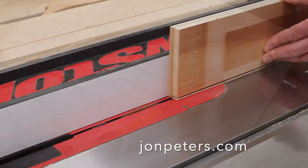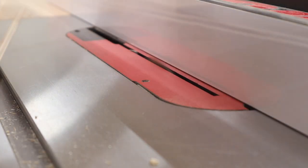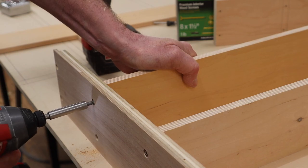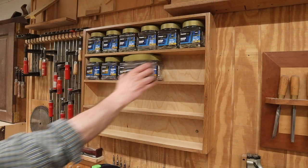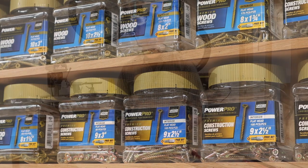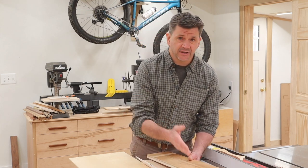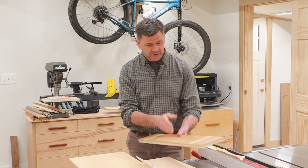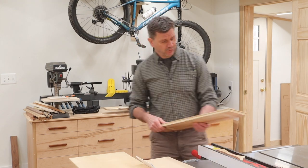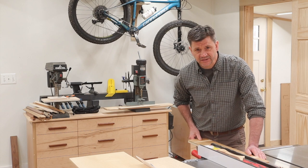Today I'm going to build an organization cabinet for my screws. I'll have a drawing and cut list on my website if you want to build this project — you can find them at the link in the description below. The nice thing about this project is it's not going to take a lot of material, and there's a good chance you already have what you need in your shop. For the sides I'm using three-quarter inch birch plywood and I'll get started by ripping the sides at four and three-sixteenths of an inch.